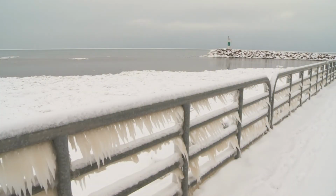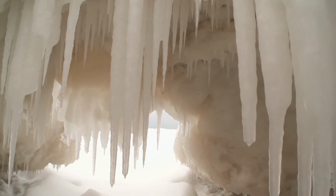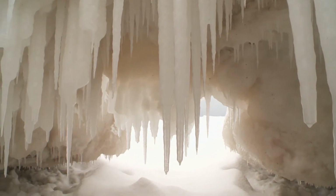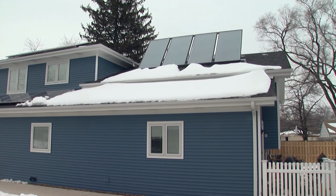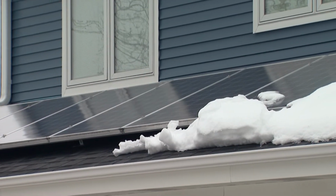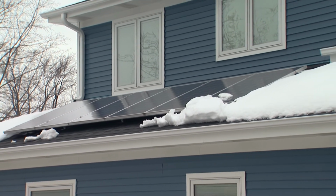We live in a climate in Chicago here that is primarily a warming condition. We're heating our building more than we're cooling it. So our vapor barriers and air barriers want to be placed in the wall at the proper location relative to insulation. In our environment, we typically want that control layer to be on the warm side of our insulation. In the southern climate, where you're in cooling conditions most of the year, it's the exact opposite. You want that control layer on the outside of your insulation. So again, you need to understand where you're building and where would be the appropriate place to put some of these layers in the building.